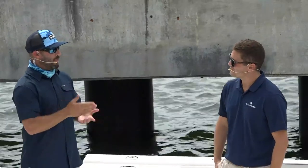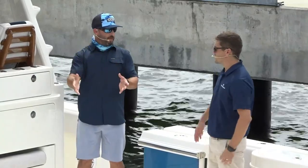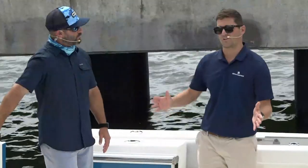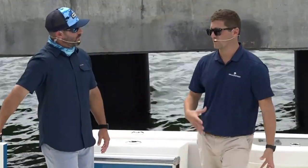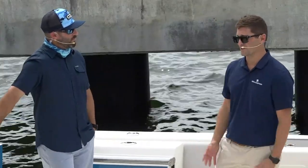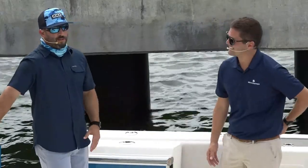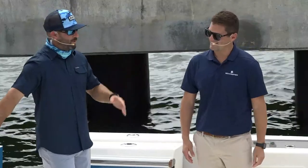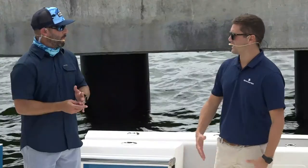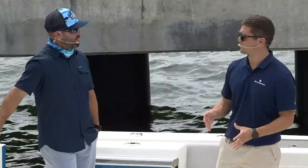One question I have: where are the cutoffs? What's the Seakeeper 1, Seakeeper 2? Seakeeper 1 is designed for boats 20 to 30 feet in length. It's our newest model, for small boats. So having one of those installed on our boat, the little Reef Runner 23. Should be fun to see, and Nick's going to be a big part of that. We'll show you more of that later. So it's not weight, it's length you go by? It's length and beam. We have an algorithm that we use to calculate the perfect Seakeeper for what model boat.